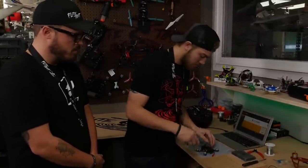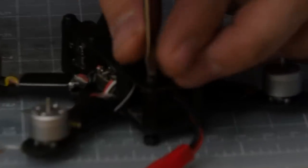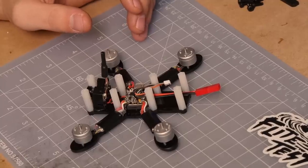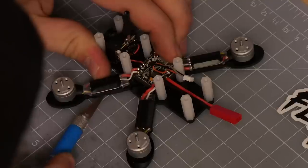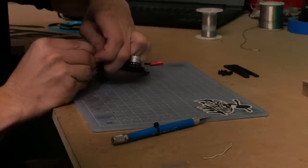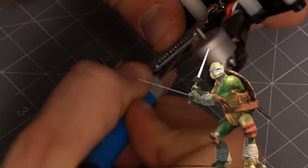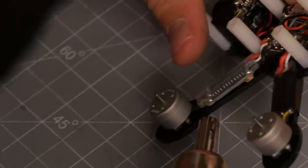First step will be to start disassembling our Gremlin. These screws are pretty small — you might need a smaller screwdriver or even a flathead. Depending on how you've built your Gremlin, you may or may not have some electrical tape wrapped around your ESCs. On this one we do, so we're going to cut that off before we cut off our heat shrink. I like to just score along the edge line right along the arm — that should allow us to peel away the electrical tape. Next we're going to remove the heat shrink by scoring along the edge line of the ESC, hitting it with some heat so it expands, allowing us to tear it open.